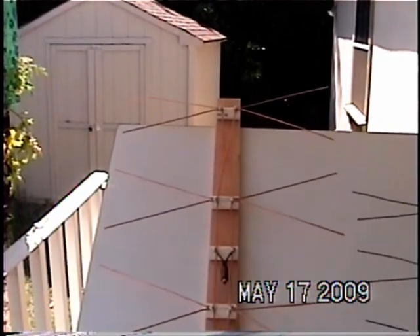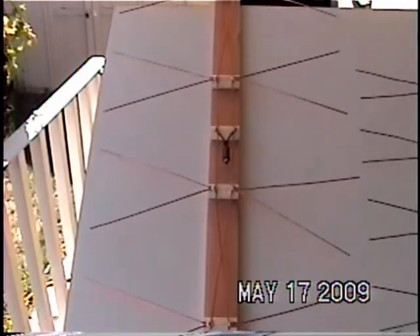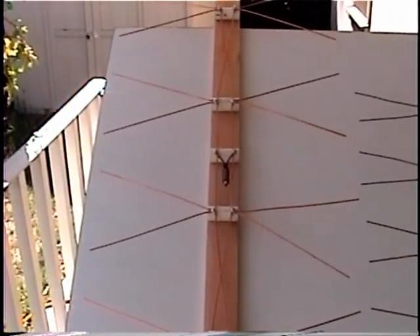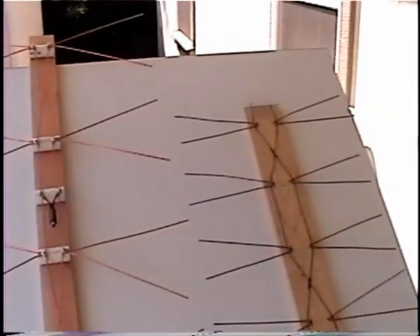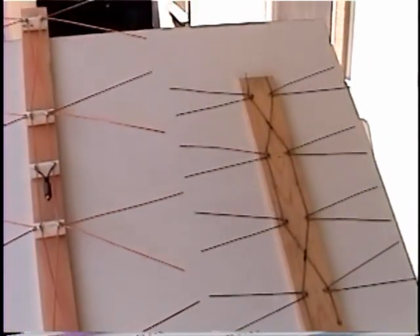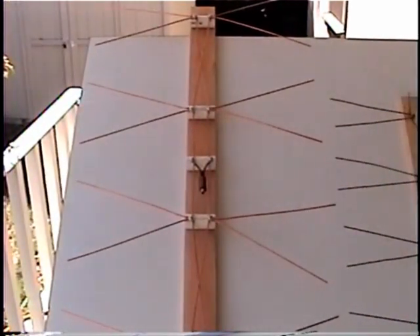Here's a look at the antenna I want to show you how to make in this video, and I also wanted to do a comparison to the coat hanger design. Notice that I'm using copper wire and I have PVC standoffs on my antenna. The reason for that is that if you mount directly on wood, you'll lose efficiency from the antenna. Mounting on plastic is really far better than putting it on wood, and there are other important differences as well.